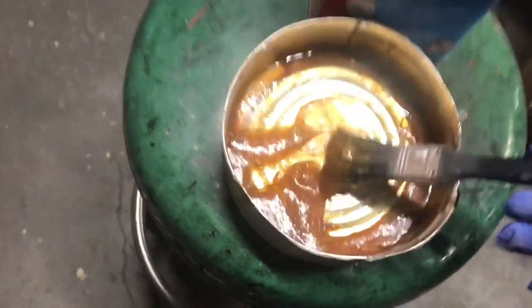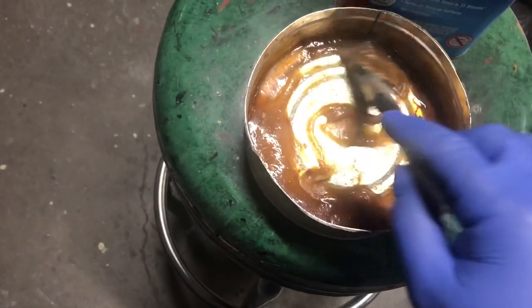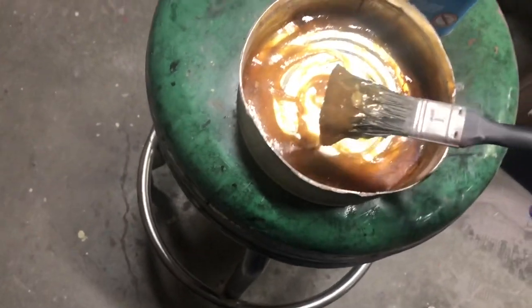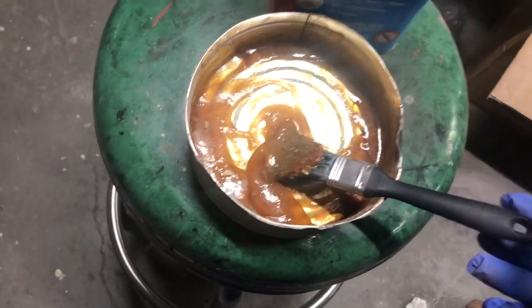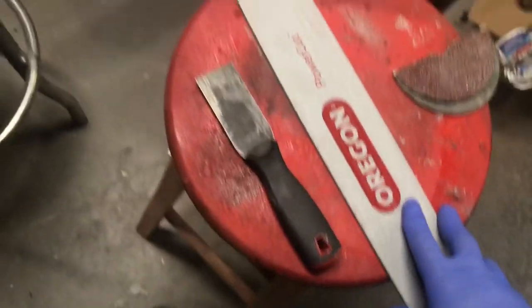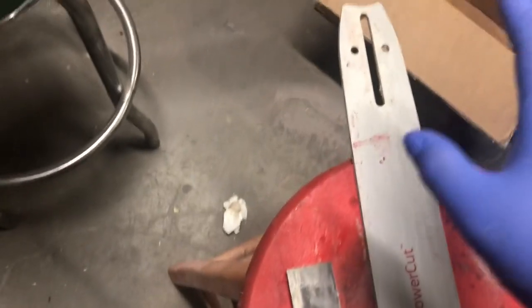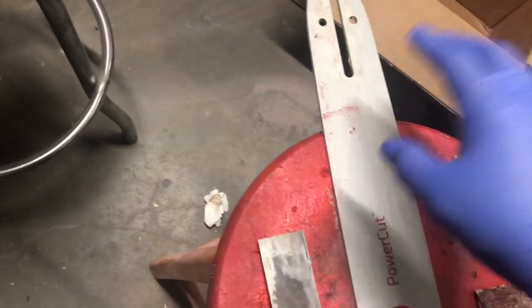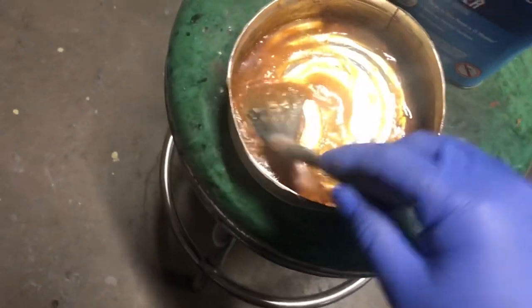Here's some poured already into a non-corrosive pan. It looks like applesauce — it's usually not this dark, it's just because this is the pan I designate for this stuff. Make sure it's a safe paintbrush to use too. I'll put an application on half of it so I can hold it while scraping. I'll do two applications — put the first one on, wait 15 minutes, scrape it off, then add a second one, scrape it off, and do the same on the other side.